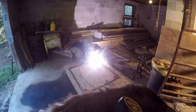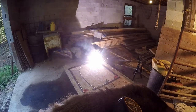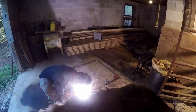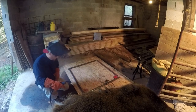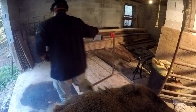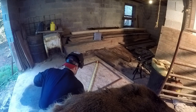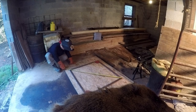Then start to get it welded up. I didn't want to weld every corner, so I just welded a corner — I think I did actually two. Then I'll flip it over and check for square again, because sometimes after you tack things and flip it over it can get a little wonky if you're not careful. That's why I do a bead or two complete before flipping. Even with one bead in a corner you can still hammer it a little straight again. Once I flip it over and make sure it's square corner to corner, and once I was certain everything was square, I went ahead and started laying beads, continuing to make sure everything stayed square after each corner.